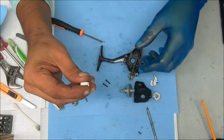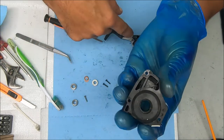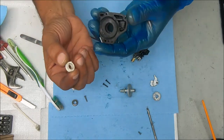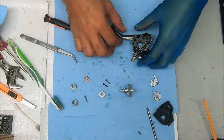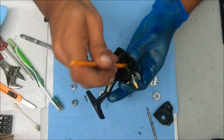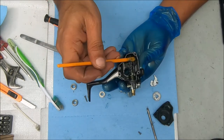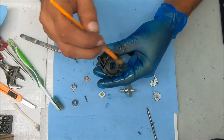If you were going to reuse your bushing — notice there are two tabs on the bottom. If you look inside there are two little notches, one there and one right there. Those two notches will be facing down into the tabs and it has to fit inside those tabs to be correct. Add a little bit of grease where that bearing is going to sit, some along here where that block rides, around where that crosswind gear will be, and along this side — nothing crazy. We can also go ahead and grease inside here where that bearing is going to sit on this side.